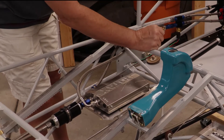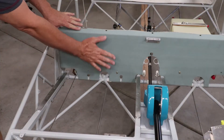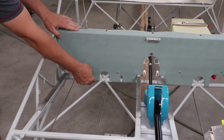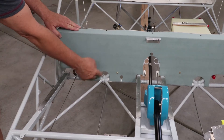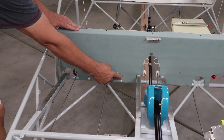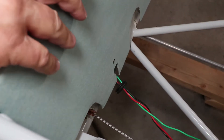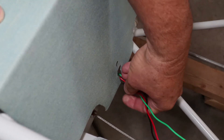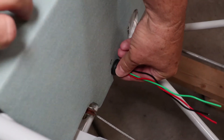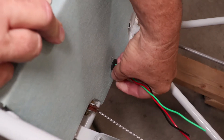Lastly on this side, I'll pick up the wires from the pilot's control stick switches. The co-pilot seat backs up to a partition that I've already covered with fabric. When I built up the partition, I included a couple of holes for electrical harnesses, sized large enough for rubber grommet feed-throughs. Notice that the holes are actually keyhole shaped, which allows me to run the wires through the rubber grommet to prevent any chafing against the metal bulkhead, while also allowing easy removal of the partition for maintenance.